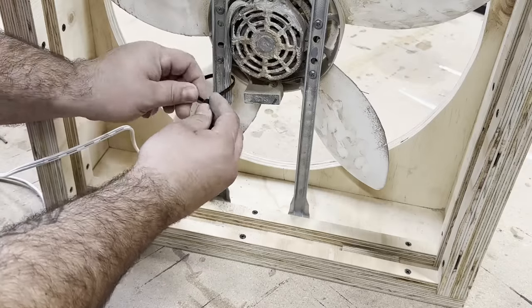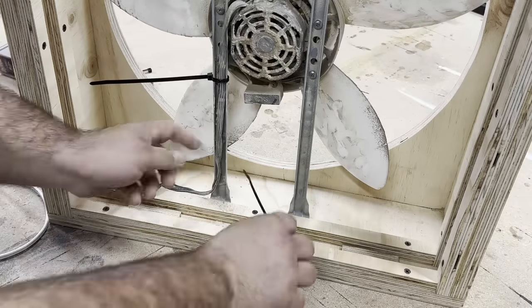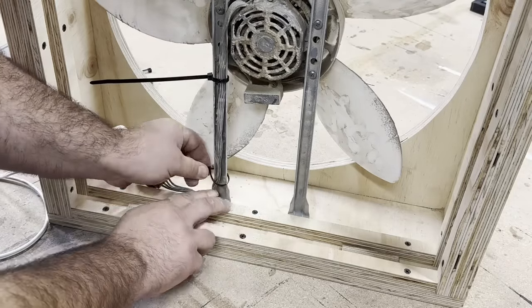Next I needed to run the cord and speed control to a spot out of the way, so I used zip ties to secure the cord to the mounting bracket. Then I drilled a hole in the side using a Forstner bit and pulled the cord through it. Now this is something I haven't seen anyone else do — I wanted to install a remote control outlet on the side so I could turn the fan on from anywhere in the shop. I was thinking I might want to hang it from the ceiling at some point, and this would make it much less hazardous to turn on. It only took one screw to hold it in place, and I used cable clips to keep the cord tidy. I'll leave a link in the description.